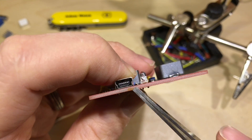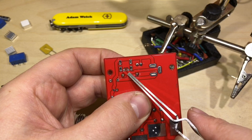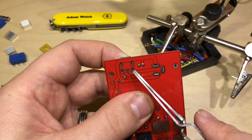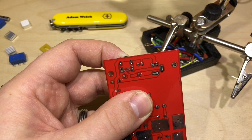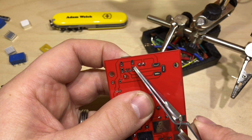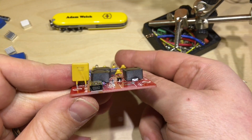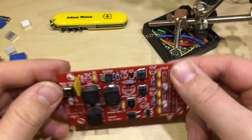It has to be said this PCB is quite thick, and that means the pins of the USB connector barely come through the through-hole vias here. I think I should just be able to solder — I only need to do positive and negative; the three in the middle are the two data pins, plus a fifth one. And there are four connections to actually hold the socket on the board. I've gone ahead and put the poly fuse in — the U300 — and the mini USB is nicely on there too.